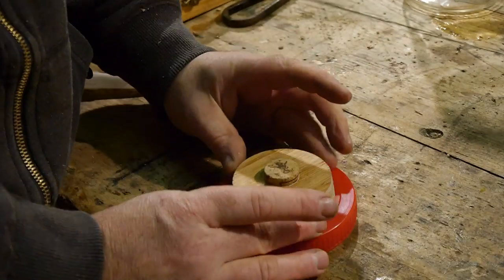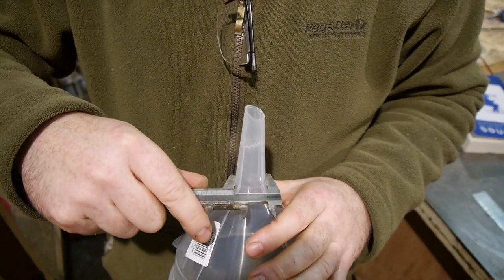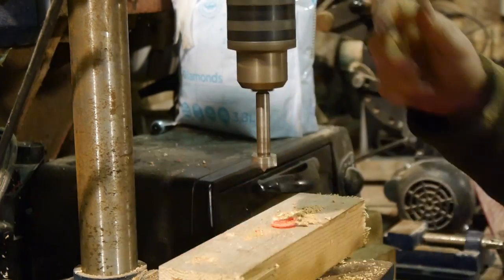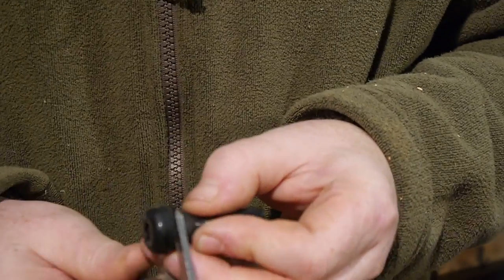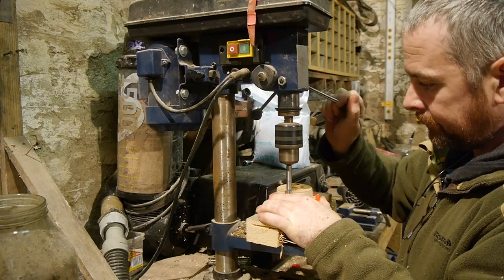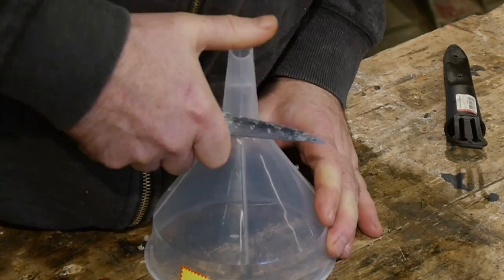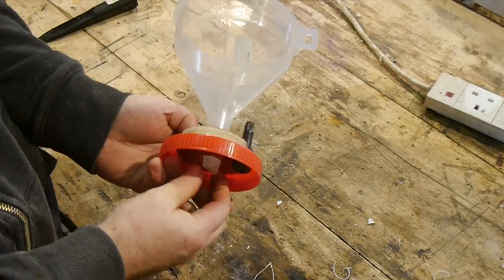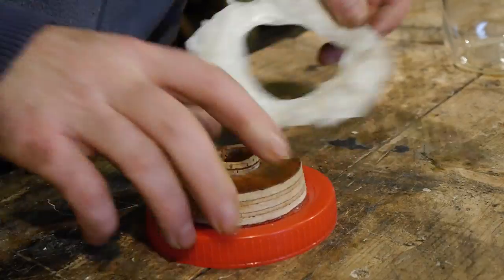To start we prepare the vacuum vessel — a large wide-mouth one-litre jar. On top I need to make a support for the funnel, so I take some three-quarter inch plywood, drill a hole in the centre and place in a cork. The cork creates a nice airtight seal around the stem of the funnel. To attach the pump to the vacuum flask I use a valve from a tubeless car tyre, which can be picked up at any auto factors for a couple of euro — a super simple and reliable way of connecting any vacuum chamber to your pump. The funnel has ridges on the outside to allow air out when pouring liquids in, so I need to take those off with a knife. I tape up the lid and give the piece of wood a coat of lacquer to protect it from spills.